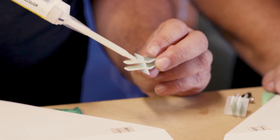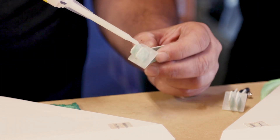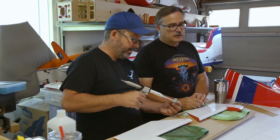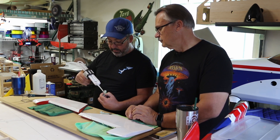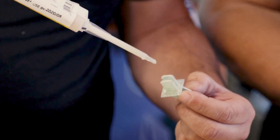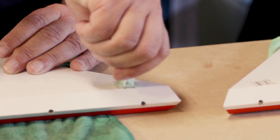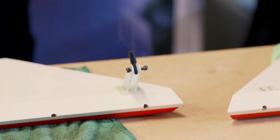Epoxy is a perfect gap filler — that's why we use it. It fills in any gaps and bonds all the surfaces. Make sure we get a little bit in these holes, which are designed to give a little grip. Epoxy goes on both sides when you slide through, then goes through the hole and creates a bond all the way through — a monolithic bond. Put a little bit on the base plate too; if you get heavy with it, it will squeeze out when you press down.